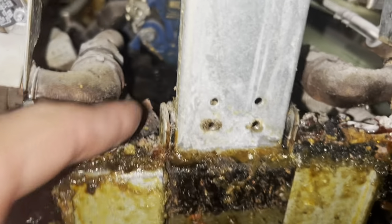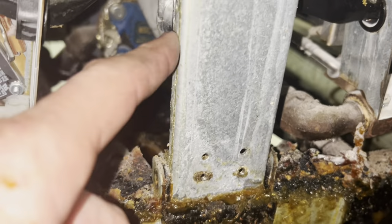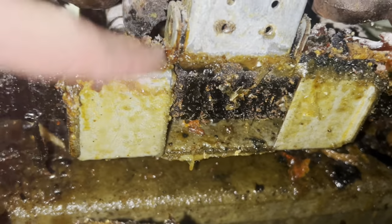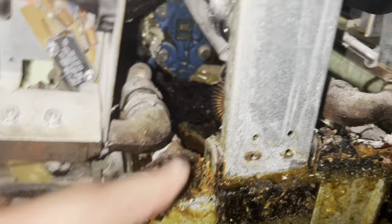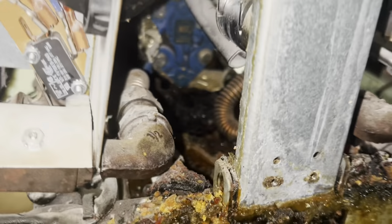Yes, the back panel does come off — and here's our pump. This bracket is going to have bolts on the front that loosen, and it's going to push back and unhook, then drop down and pull out. When I was looking to see if I could unhook the electrical from back here — not so much.